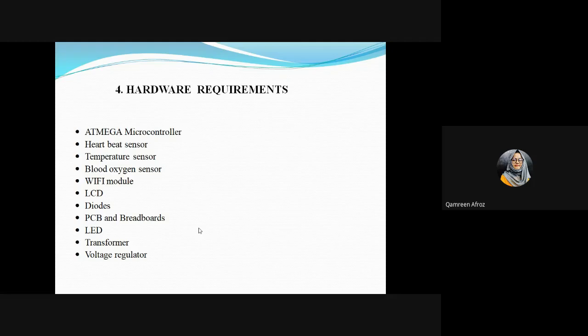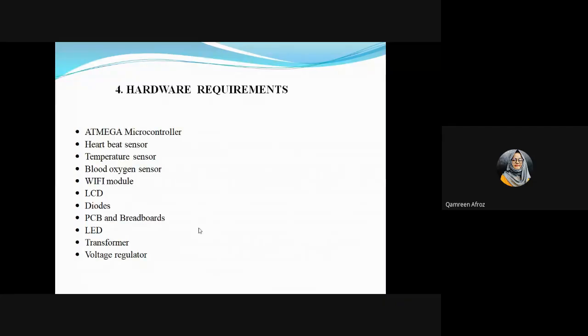And then coming to the voltage regulator. A voltage regulator regulates the voltage; if you want a constant voltage, it regulates the voltage. Now in our project, one is IC 7812 and one is IC 7805. It is a voltage regulator IC, and it is of the 78XX series. The last digits in 7805 indicate 5 volt; it gives out 5 volt as output. There are 3 pins for this IC: input, ground and output. If we give 12 volt, it gives back 5 volt.